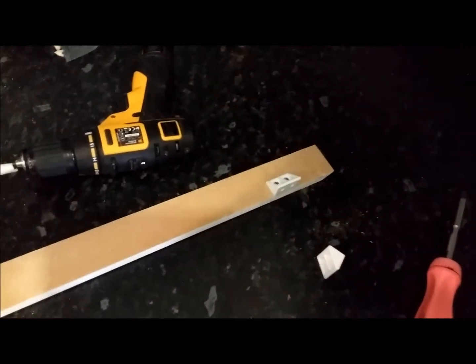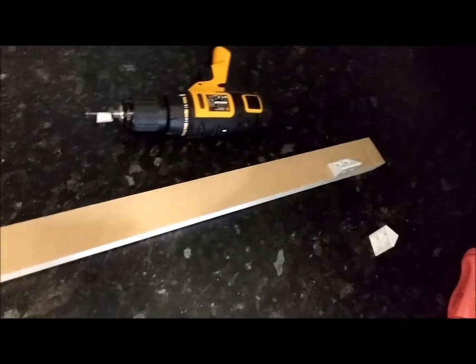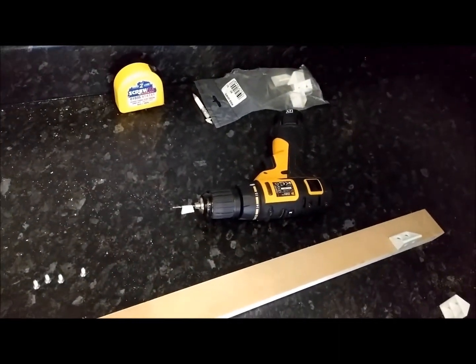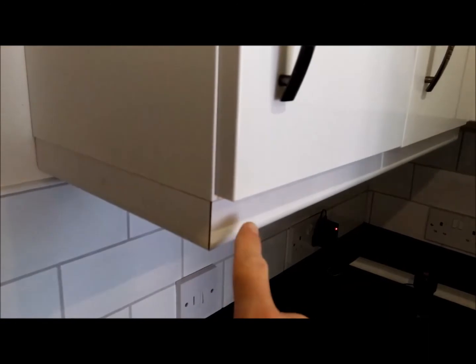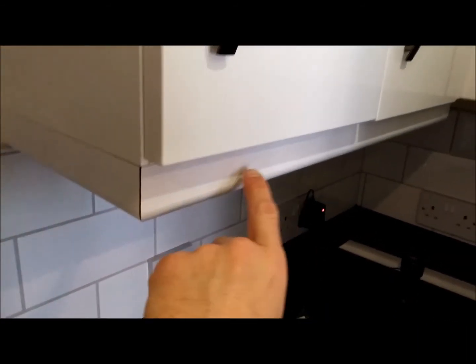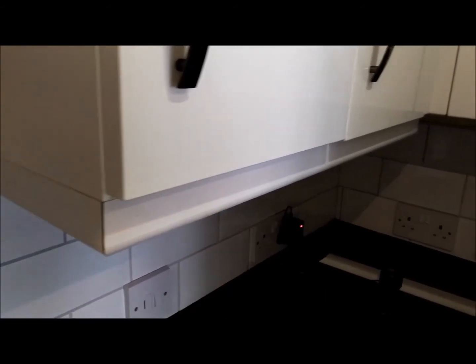Brackets attached to the next length. Remember to drill with your depth flag on so you don't burst through the front. Remember to select screws that will not be too long so they won't burst through either. Next job is to position it up and drill the holes in the bottom of the units. So the two bits are joined and the join is reasonably good. When cutting the length, don't cut the exact length — cut it a millimetre or two slightly shorter. I've just had to go and trim it again on the chop saw so that I can get the next bit in. That's probably something to consider.